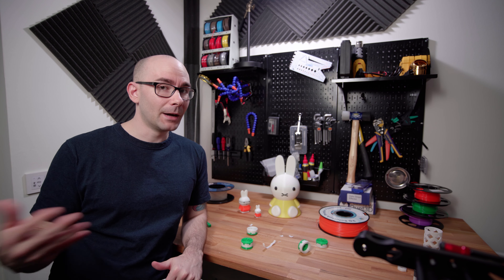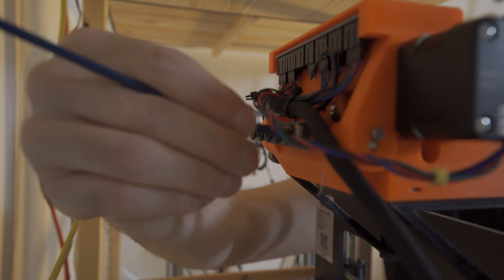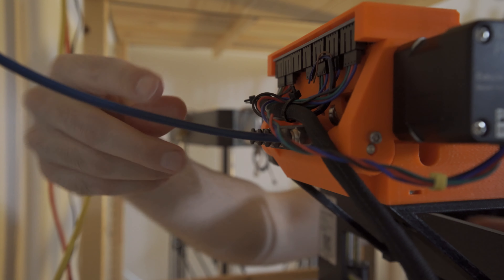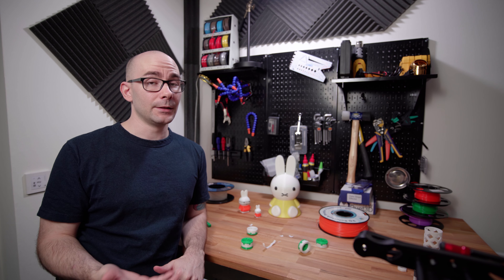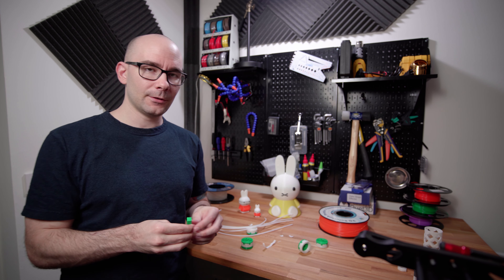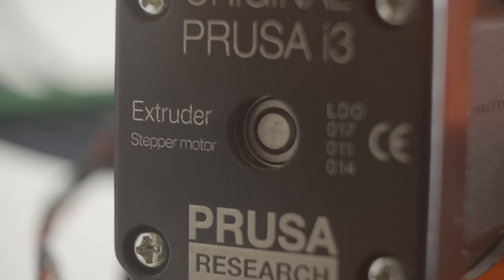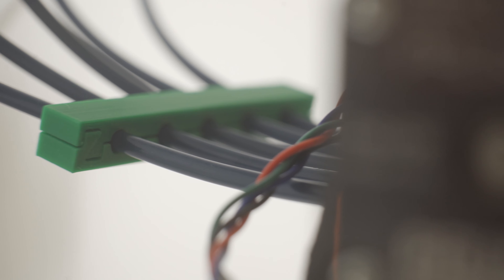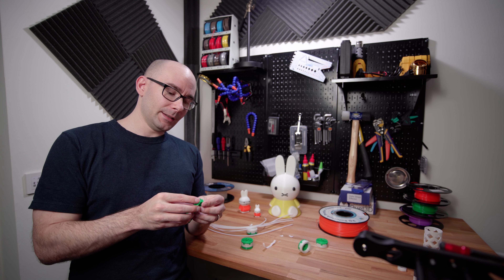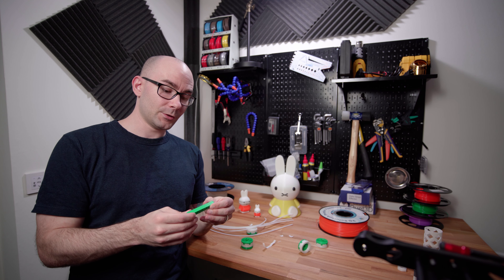Another thing is the mods. There's the M10 PTFE holder — it allows for a pass-through of a tube, and with that you can easily remove the tube if you need to do any troubleshooting, and you will have to do troubleshooting. And there's also a simple little clamp where you can feed your tubes through and it just organizes them a little better. It's amazing that the community is constantly making these products so much better than when they were initially released.